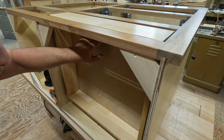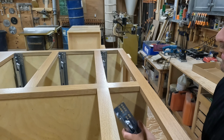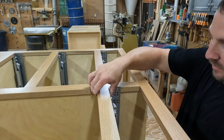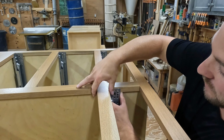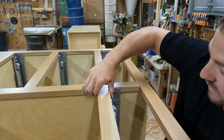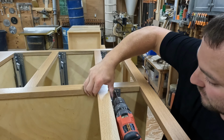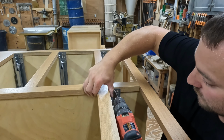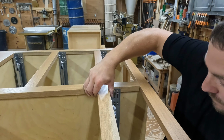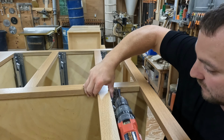Yeah, all looks parallel, flat and even, so let's go with that. Here's another angle of fastening these. Probably might be able to see it a little bit better. Yeah, so heavy 1/8. Pinch the drawer slide there. Doesn't really matter which screw hole you go into. Typically I go on the bottom. Magnetic tip though can sometimes be a pain in the butt.